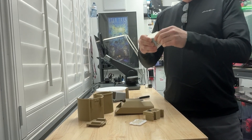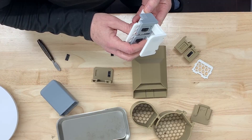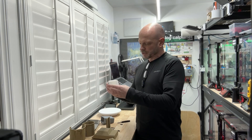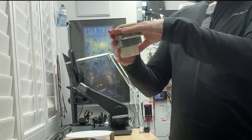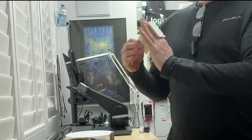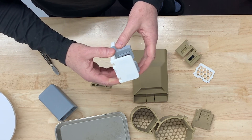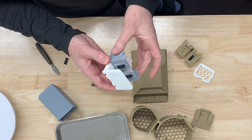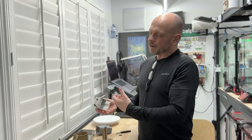It's actually kind of ratcheting because you can push it up without squeezing, since the tops are chamfered — but that does wear the teeth a little, so it's better to squeeze the sides and move it up and down to the height you want. Once you get it as close as you can to a table surface, you pull the lever down, which flexes up these two compliant components in the moving platform and compresses the space in between. Once that's folded down, you can't squeeze it in, so it's effectively locked in place.